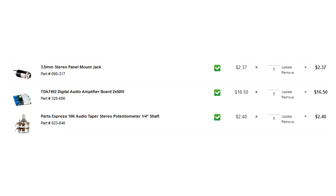Only the smaller components are needed now, like the potentiometer, 3.5mm jack, switches, and external connectors. When designing a stereo speaker box like this, make sure you get a potentiometer with two sections, one for each channel. Also, because I'm making a sealed box, I tried to make sure to get a nice sealed 3.5mm jack. As for the switches and connectors, I had quite a few things lying around to salvage from. These components can be purchased easily through Digi-Key or similar websites, but salvaging is always a good option because it's free. Just make sure the switches are panel mount and the right size.